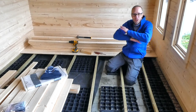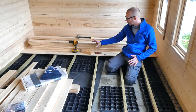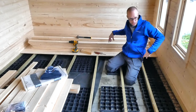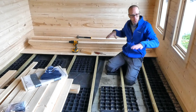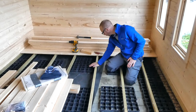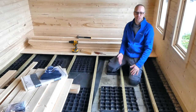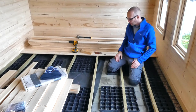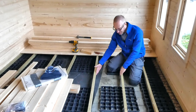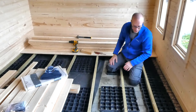Now, I didn't need to completely cover the base with the plastic sub-base, as long as the outside was. So the outside, the perimeter, is one complete unit, and then I've got 12 that go in the middle, and these support the floor bearers. There's no more than 400 mil. I think it's about 370 is what I measured for each gap. So there's no more unsupported gap than what you've got here. And this is 400 mil, and this is about 370.